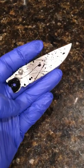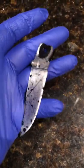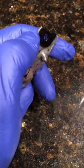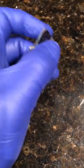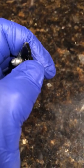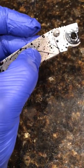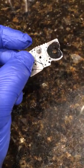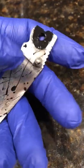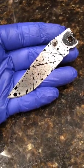I've got my pattern on the blade — this is what it's gonna look like before the acid-etch with the ferric chloride. You'll notice I also have the vital areas masked off with nail polish. I always do that on the parts of the blade that affect the action: the flats where the washers ride, where the lock bar makes contact, and where the stop pin locks against the blade. Even though the ferric chloride only etches a fraction of a millimeter, that could affect the action, so you need to protect those areas.